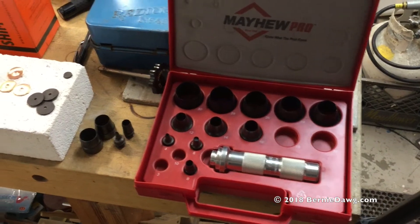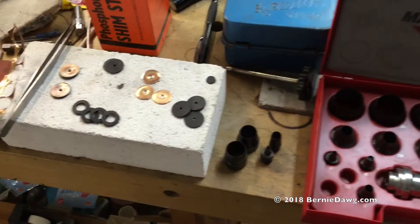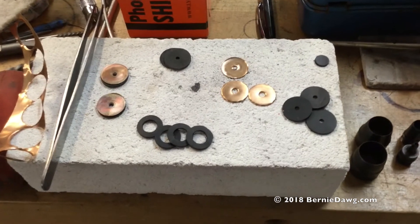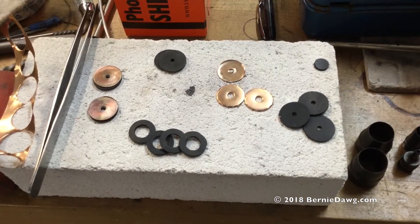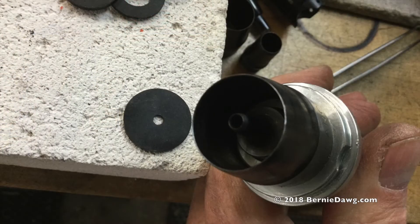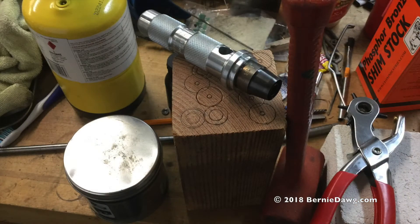Viton would be better. I used a concentric hollow punch to punch out both the brass and the rubber gaskets. For the safety cap gaskets, I used a 20mm outer diameter and a 3mm inner diameter. I beat them out on the end of an old 4x4.